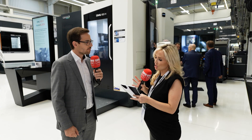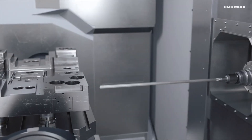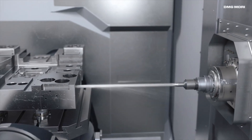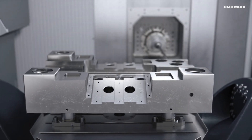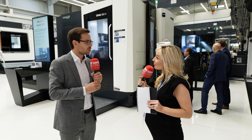What's the main advantage of this machine over a vertical five-axis? The main advantage really is the horizontal spindle and therefore the perfect chip fall that we have with this machine. We also have very good deep hole drilling capabilities up to 650 millimeters on this machine size, which is usually two sizes larger in a vertical machine. When you have an 85 vertical machine you would need a 105 or 125 machine to do the same deep hole drilling that you can do on this machine.